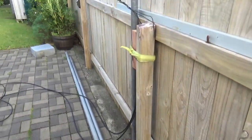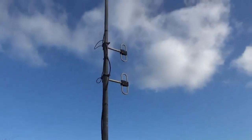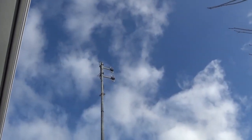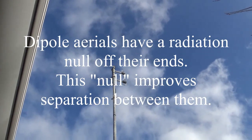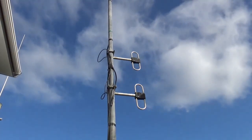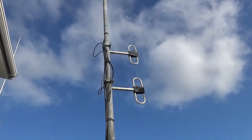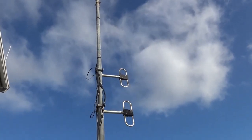We're at Pete's place to have a look at the testing Pete's done on the PRS aerials that are going to be erected for this PRS repeater, which is going to be at Brinduin. We've got a pair of antennas at the top with a combining harness, and then another pair of aerials down here — you can probably see the combining harness on the lower set. Everything's nicely taped up to keep the water out, and it's three meters between the aerials.